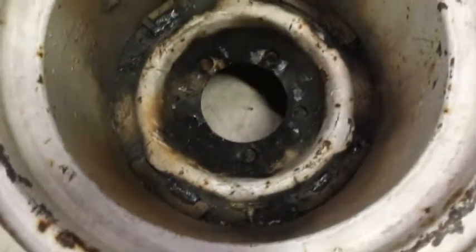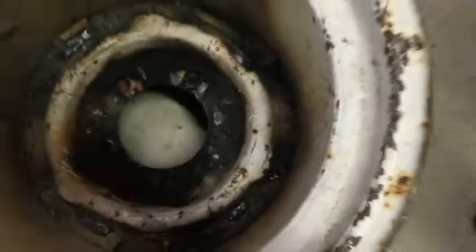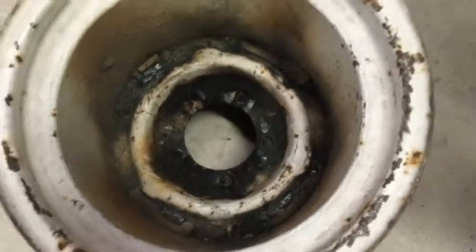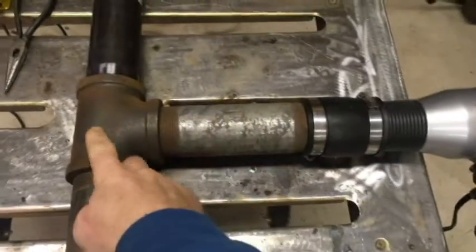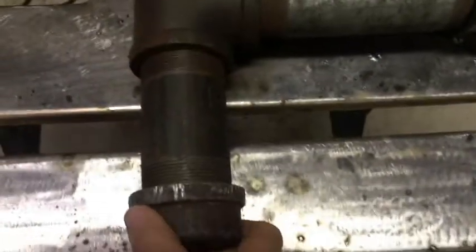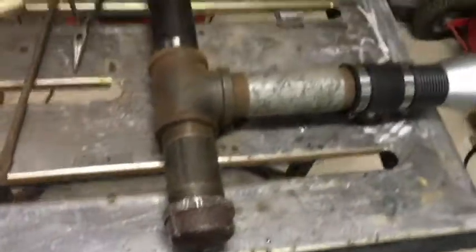I got the holes I wanted filled in, all filled in — roughly good enough. I just didn't want coals and crap falling out of that. I might put a mortar in the bottom, like mortar for fire bricks. And I have mocked up my blower — it comes into a T — so we'll go up to this flange. The flange is going to get welded in there. I'll use this as a drain; any ash that falls down I'll be able to clean that out that way.